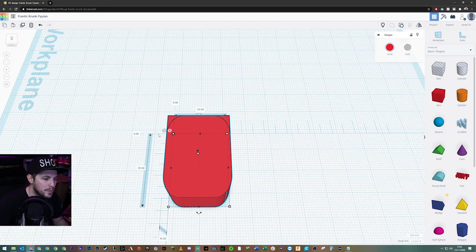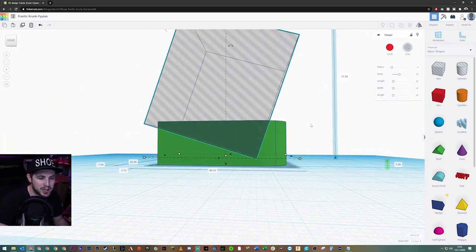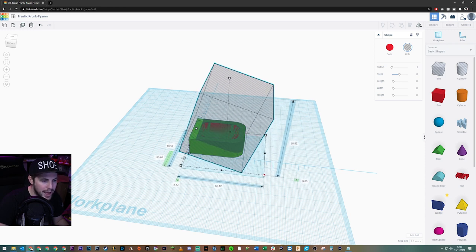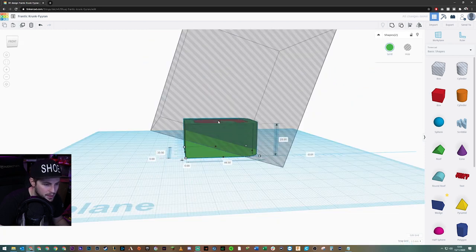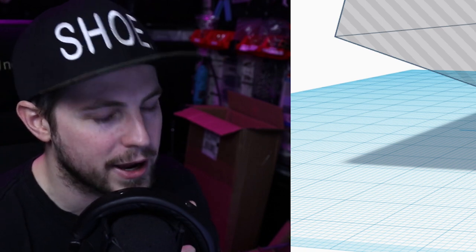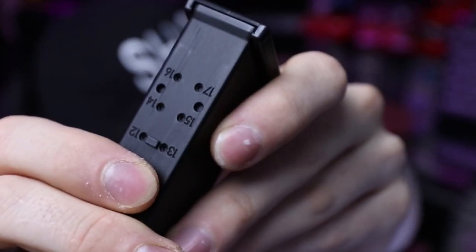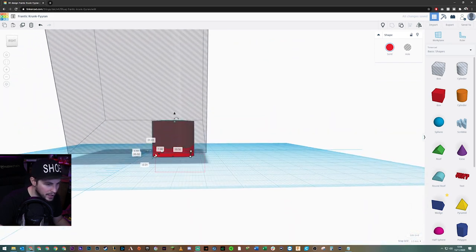So with 5mm of material on each side, 6mm on the back, and 5mm at the front, we click the light bulb and get this shape back — slightly adjusted for the extra dimensions. I need to enlarge it and select these two shapes to make them taller to fit. There's one more thing to account for: on the back of the Glock magazine there's a little nubbin, and on other brands there are nubbins on either side, so we need to accommodate those — otherwise the magazine won't slide all the way down. And just like that, it sits perfectly in place.